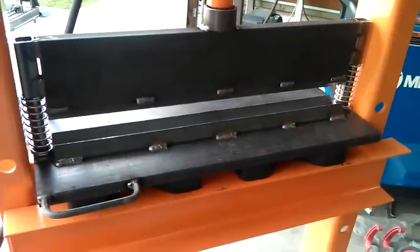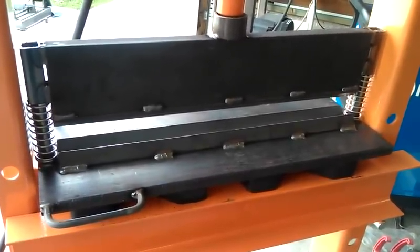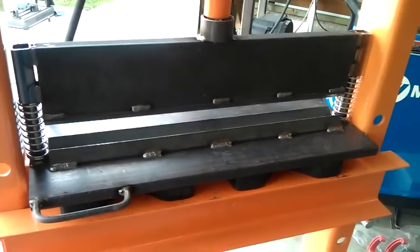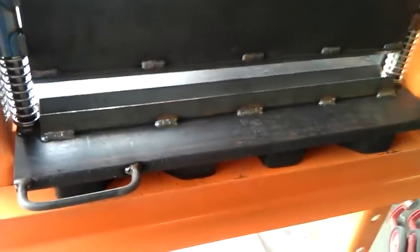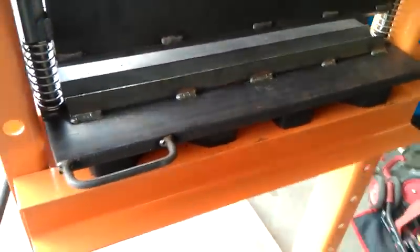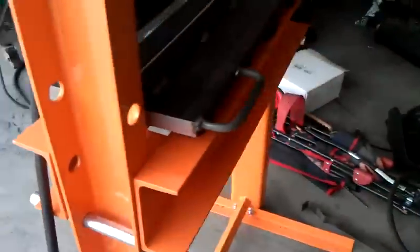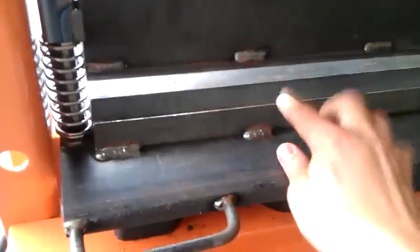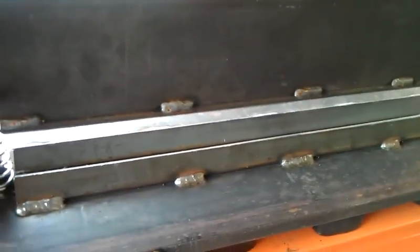Here's the little brake that I made. I can't remember the width — 22 and a half inches. I just made it as big as I could for that area. The bottom plate right down here is 3/4 inch thick by 8 inches wide. It spans from end to end on the supports. Sitting on top of that I have 1 inch by 1 inch by 1/4 inch angle iron, just set in a V pattern, with some welds on the outside.